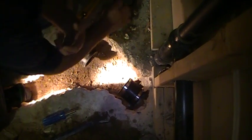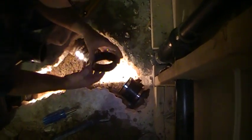We couldn't put a full Fernco coupling on, so I just took the utility knife and trimmed this off. The thing about Fernco couplings — the entire fitting is smooth inside — so I'm cheating a little bit, but it'll work fine, not a problem whatsoever.